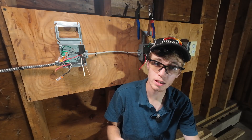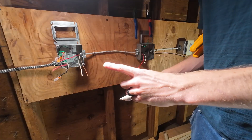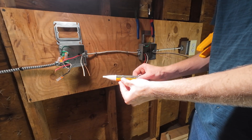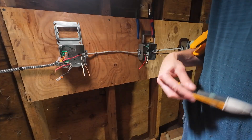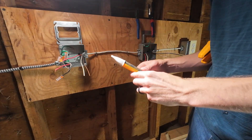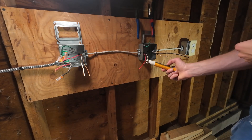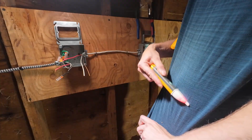When you enter a room and there's two switches that control one single light, that's a three-way switch. Let's get to it. Start off in your panel box and turn off the breaker that controls the circuit you're working on. Then get your non-contact voltage tester, press it — you heard the beep. Turn on, run it on some clothing, you hear that beep — that confirms this device works by picking up static electricity. Touch all the conductors in the area you're going to be working on. It's not beeping — rub it on the clothing again.